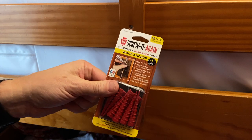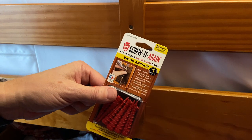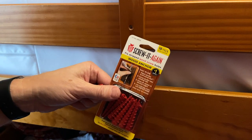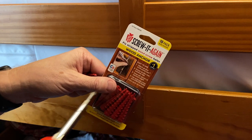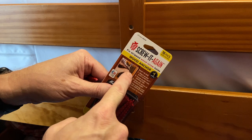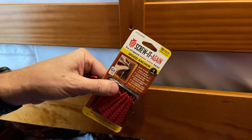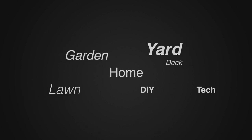We'll put a link in the description below so you can check this out. Again, this is 'Screwed Again' — these are wood anchors which will help you get things secured when the screw is stripped out. One great spot to use these is on doors, especially interior doors with pressed particle board simulating a door frame — after time they start to get loose and strip out. We're going to do another video showing how this fixes that problem. This is John Young, thank you for watching. For more tips and how-to videos, go to weekendhandyman.com.